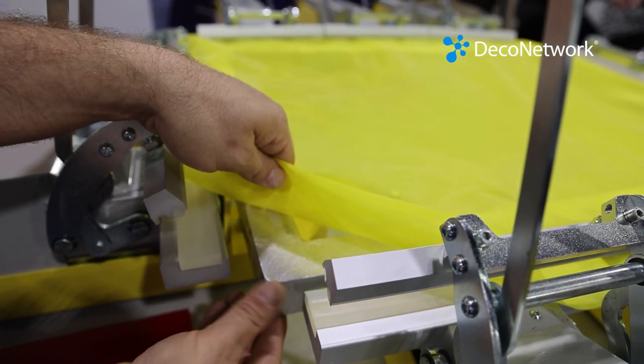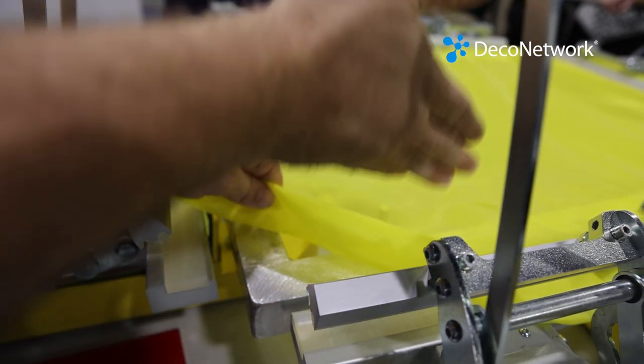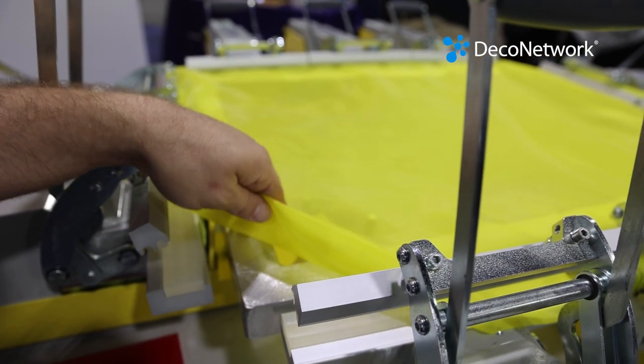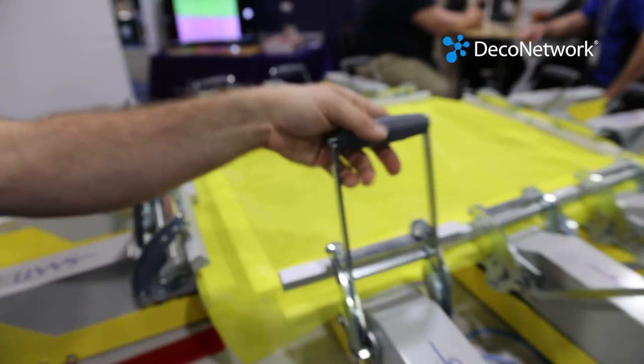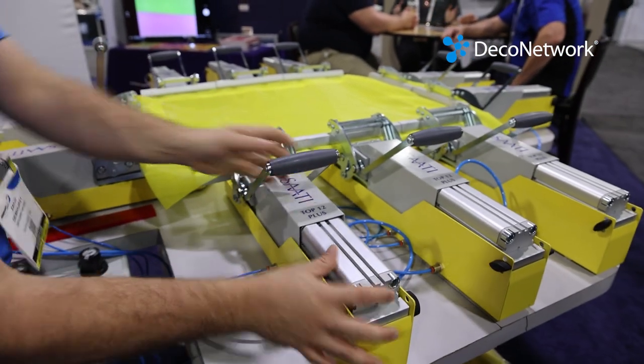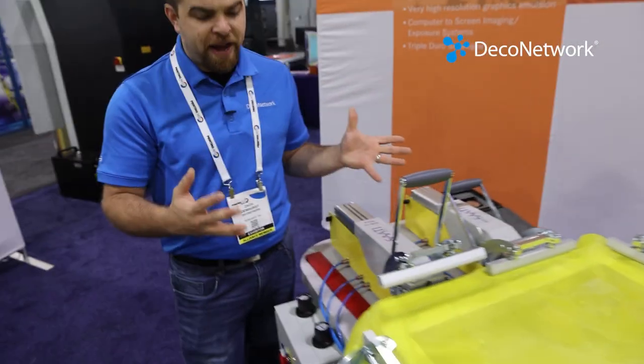it's typically because it just starts to lose the tension and starts pulling away from the corner. So the first thing you want to do is round that corner, make sure you have a nice surface so that when you glue it, it adheres to it and holds it down. If it's smooth, it's harder to do that. When it comes to stretching screens, you can often stretch multiple at a time, but when you do one screen at a time, it works better.